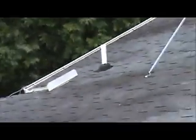Okay, we're gonna come over here. And you've got the same thing going on. This one here is busted real bad. You got exposed water coming down around your pipes. Again, on the main house, there is nails popping up on this ridge vent, which would allow the water to come in. Nail heads need to be recaulked, and there is a third pipe down there that also is going to need a new flashing.